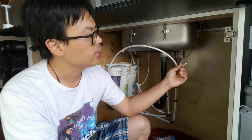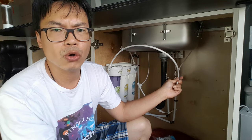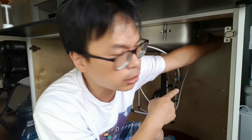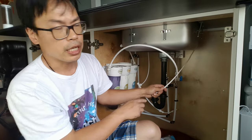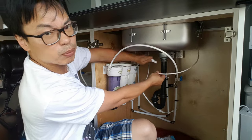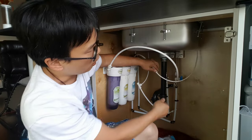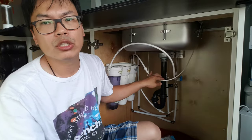So this is our pre-demo. This is a quarter-inch line. You will have to drill a hole above your counter on the countertop, and then come through into the cabinet so that you can access the cold water. If you only have the adapter, just connect it from three-eighths to quarter-inch and connect it. After you drill the hole, run the line through and come down. You need a quarter-inch drill bit to do that. Let me show you how mine is done.